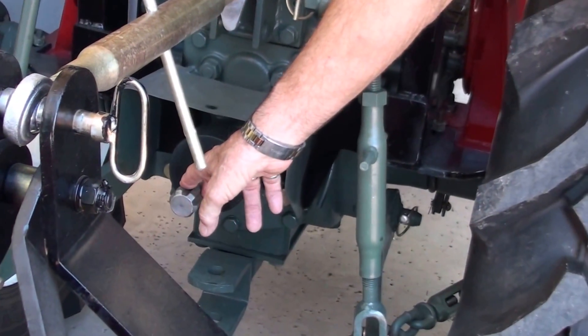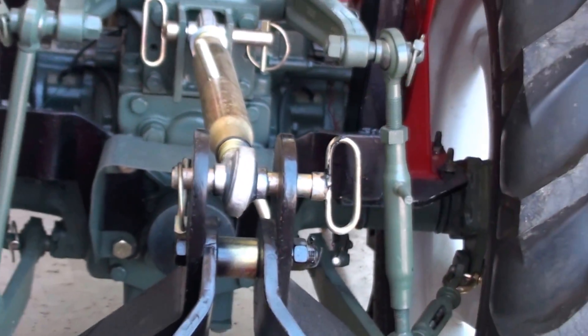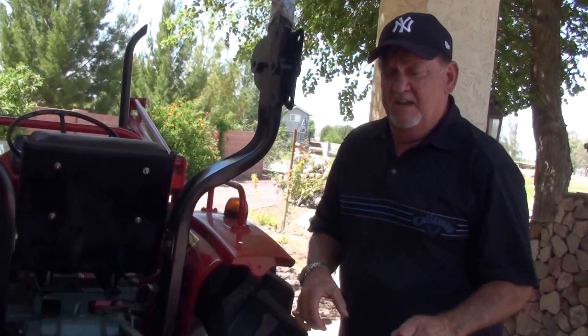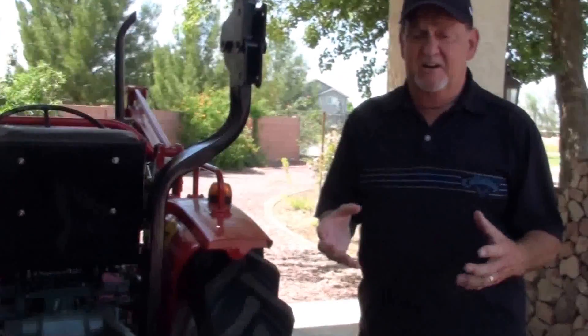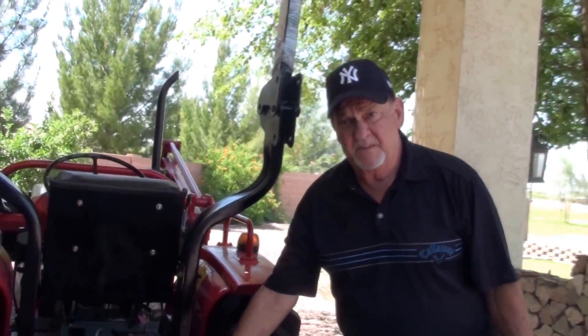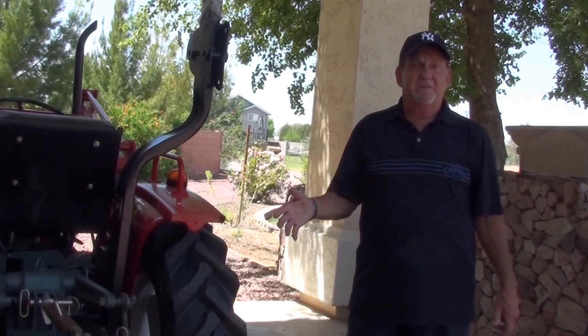You also want to make sure you have a PTO — called a power takeoff in the industry. The value of this is it's a gear drive that runs common things like a mower, a post hole digger, or a tiller. Anything that has a motorized piece of that implement requires a drive train to make it work. A post hole digger will dig post holes around your property. A tiller will pulverize your garden — literally strip that ground down to powder. A mower comes in either a finish mower for cutting your front yard, or a brush cutter for knocking down grasses in the field. My advice is don't buy a tractor unless it has a PTO, because you don't know what the future holds, and it affects resale value too.